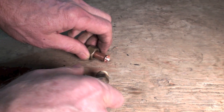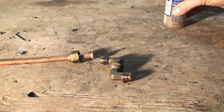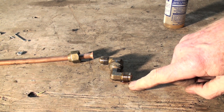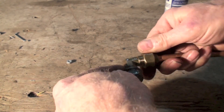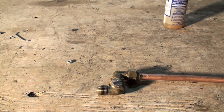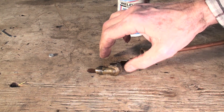The first and simplest tip is to oil it. I'm putting oil on the threads so that when I thread this together there's less friction. Remember, the threads don't seal anything — they're just to tighten it down. The oil makes the nut turn easier on the threads and squish better against the sealing surface. Just a little bit on the surface, tighten it up — don't go crazy, but they need to be tight. Use two wrenches.